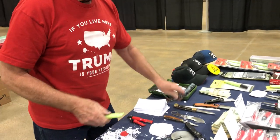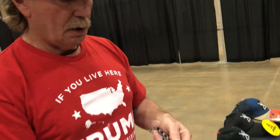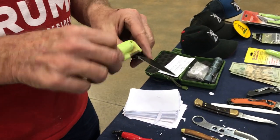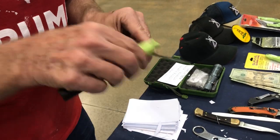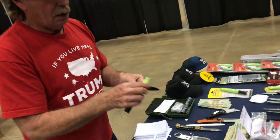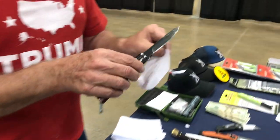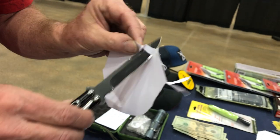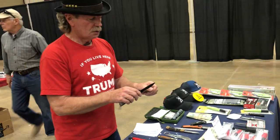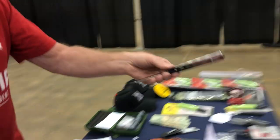There's a corner there and a corner there, so I can work out on that corner, come back on this corner — out that way, come back here, out that way. I'm going to put a little more pressure on it, cut a finer edge on it, just like that. Then I'll lighten up and take that wire edge off the blade. That's probably getting close enough to sharp, as thick as it is. If it catches and takes the fingernail off, it's sharp enough. Little tune-ups frequently — that's the key.